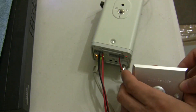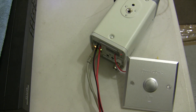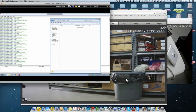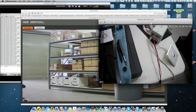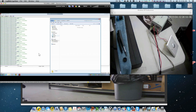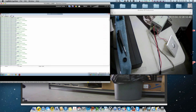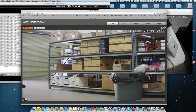Once that wiring is in place, I'm going to log in and show you what things you have to configure in the camera interface to successfully enable this feature. I have three windows open here: one is another megapixel camera on the network so you can see what happens every time I press the button, and then there's the FTP server on a remote location. I'm using FileZilla for FTP — it's easy to configure. This is how we do the test, either remotely or internally on your network. You have to log in to your camera.